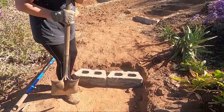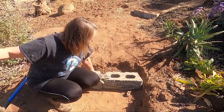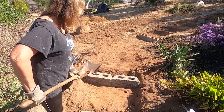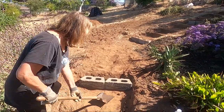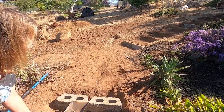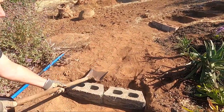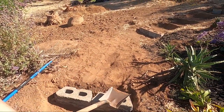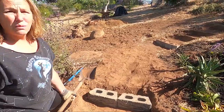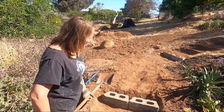This is what the brick looks like that I'm going to be using for the stepping stone. I make it flat — I've used my level to make sure it's flat this way and level this way. The way you make these steps is you flatten out the ground and make it the depth of your brick. The next step should be parallel to that, and then when you put the capstone on it makes this lower than this and you fill it with gravel, which gives you a nice firm, solid platform to step on.